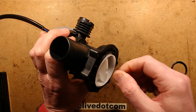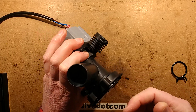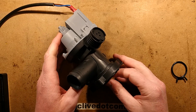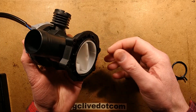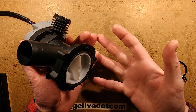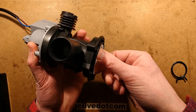If I unscrew the filter here — here's an interesting thing. A friend in America had a front loader and they had some debris go down inside, change or something like that, and it blocked the pump up. Now, in the UK, all you do is take the front plate off the washing machine and you get this little port in the front of it. Keep in mind if you do this that if the machine's got water in it, all the water will suddenly come out this port — and that can be quite a lot — so have trays and go at it very gently.